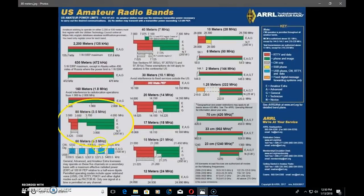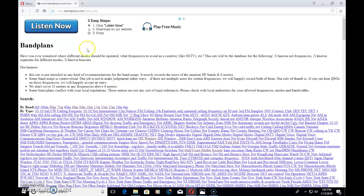A lot of people on 80 are using amplifiers and long antennas. So if you're a newcomer to the hobby, I recommend not going to the 80-meter band as your very first band. Looking at bandplans.com — lower sideband on 80 meters for phone and CW, upper sideband on digital mostly, but lower sideband when talking on 80 meters.